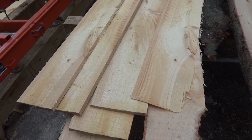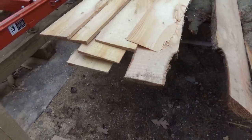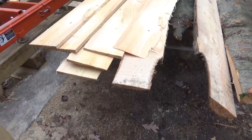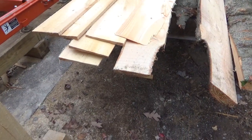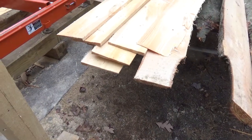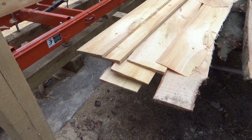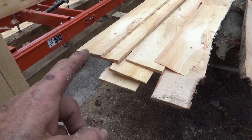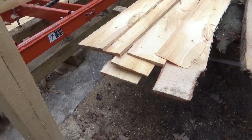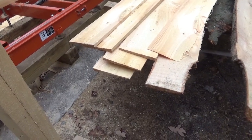So I saw a lot of people on the videos I've looked at for lap siding. Now this is the first time I've ever cut lap siding. This is not the first time I'll be hanging lap siding. So to me, if you're going to work with this stuff, it should not be face nailed. It should be only nailed at 5 inches up. That'll miss the underlying board. It'll only put a nail in the top board that you're working with.